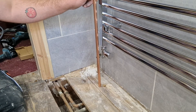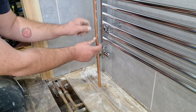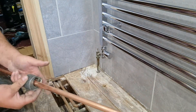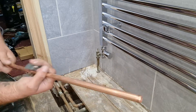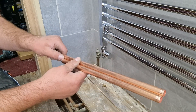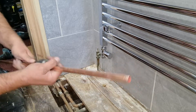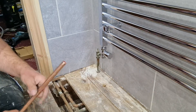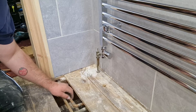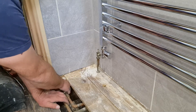Again, a bit of copper — just hold it to the valve, hold it to the floor. Then you want about three or four inches extra above the top of the valve. Just cut that off. You can use that as a template for the other one, cut that one off. So these are going to be the pieces that go through and join on. But first we need to cut the old ones out of the way. With your pipe slice, just cut them off.